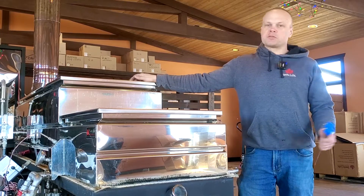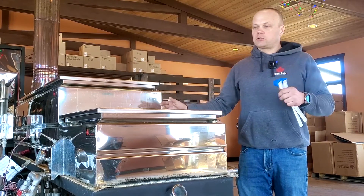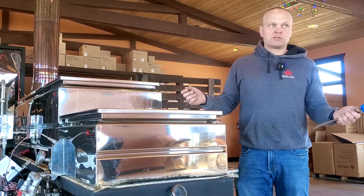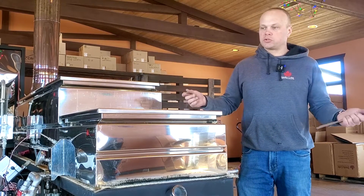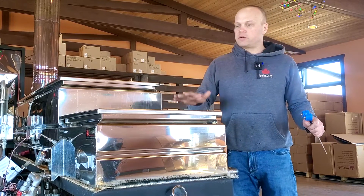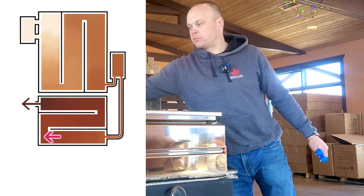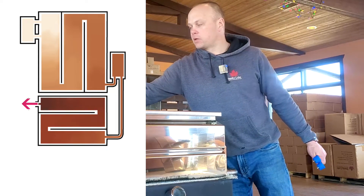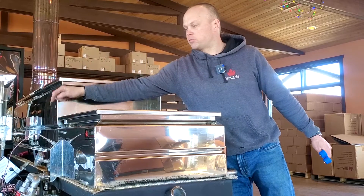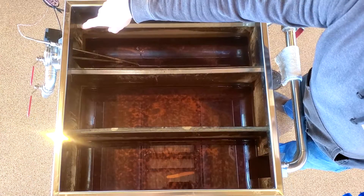The whole principle of reversing is largely understood, but for people getting into their first commercial or semi-commercial evaporator: on this evaporator, as we do on all of our high output evaporators, we're drawing off the rear compartment of the front pan. That's why you see the auto draw-off probe, the thermometer, and the valve set all on the back of the front pan.